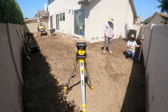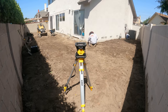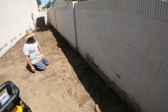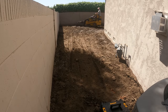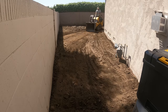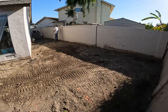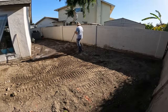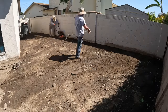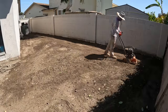On the laser level I'm just trying to establish where I'm going to drain all this water, because we're pretty much enclosed back here — there's no drainage since we have a wall behind the AC unit, and going around the other side of the house is quite a long run. So I'm going to break this yard into two directions right from the middle of the backyard, slope it two directions around each side of the house. Then I'm going to core through the bottom of that footing and throw a drain in, then go out the front courtyard under the driveway and daylight it back at the sidewalk underneath the artificial turf.